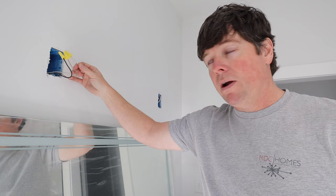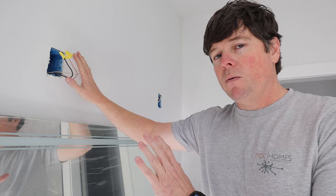If you're thinking of purchasing one of these to replace an existing mirror that you already have and you have vanity lights above your mirror, it'll be a very similar process to what we're doing here. The only difference is you might have to reroute your wires a little bit lower so they're hidden by the mirror. You're probably going to have a hot, neutral, and ground just like this that your light was wired to, but instead of wiring the mirror directly to the light, we're going to install an outlet so we can just plug the mirror right into it.